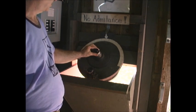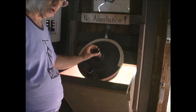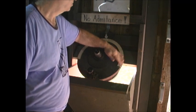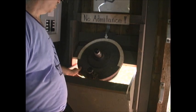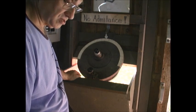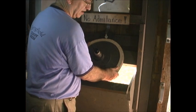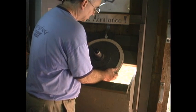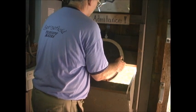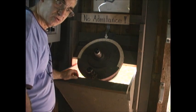This knob turns — it's threaded at the bottom, and it adjusts the secondary mirror. The eyepiece is here; it's just one we had lying around, and this actually adjusts between a 2-inch eyepiece or an adapter for an inch and a quarter eyepiece. We have degrees written on top that show you the orientation of the telescope. We can also adjust the flat so that we can look at various angles of the sky. If this turns, you can hear the flat moving, but since it's a flat, it really shouldn't make any difference if the flat moves a few centimeters. And that is the Porter Polar Telescope.